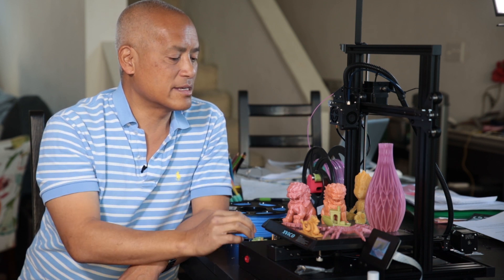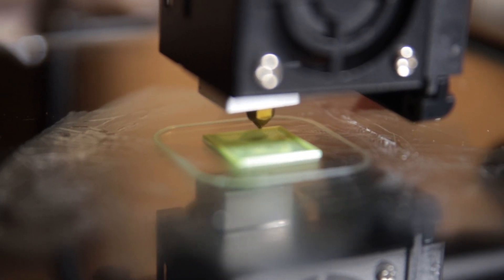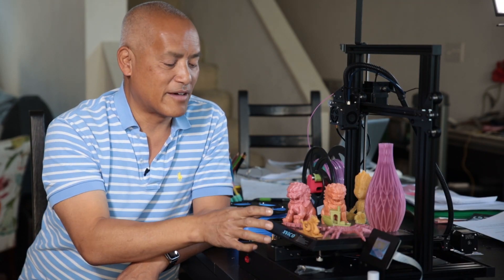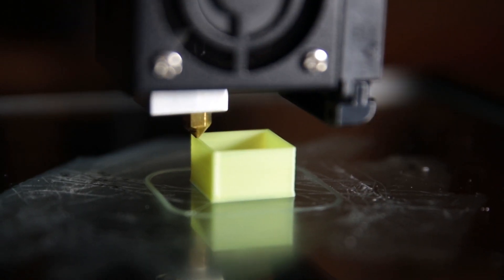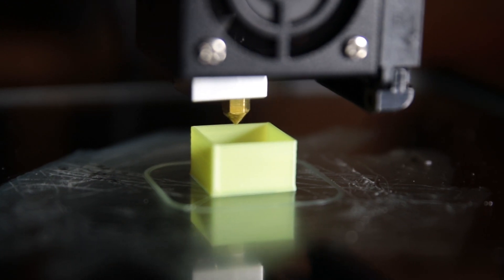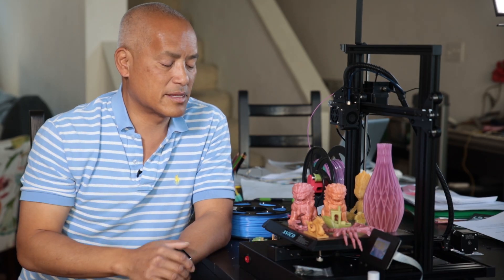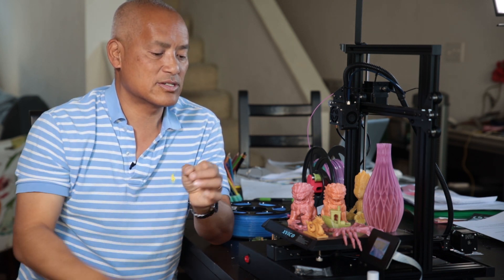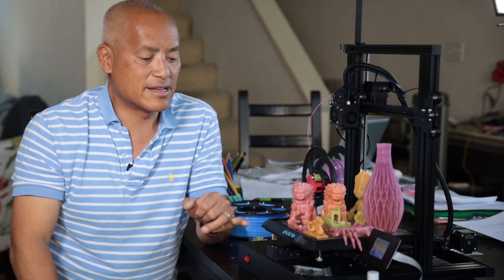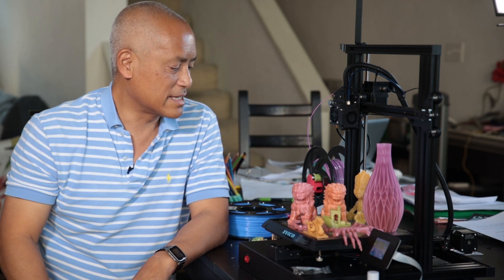I did an E-step calibration with the extruder to make sure it's feeding the right amount of filament, and I did some tests to adjust the flow. Once I got that dialed in I was able to just keep printing. I leveled the bed once and it stayed really level. There's a little round piece you can print and stick in there that helps the coupler push the PTFE tube tight against the nozzle, and I think once I do that, having that little piece of PTFE tube in there would actually be helpful.